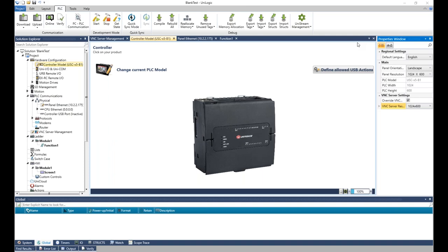There's a question about licenses and activation. You have 30 days to use UniLogic before you need to register it — at that point you will not be able to download to a PLC. To activate or register your software, there's a menu in the tools menu of UniLogic where you enter your company's information and it should send you an email with a license key. Once you get that, enter the license key into the software and you'll be good to go. If you don't get the email, check your spam folder, or contact our support team and we can help activate your software.